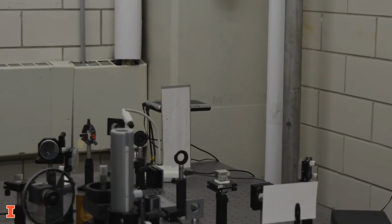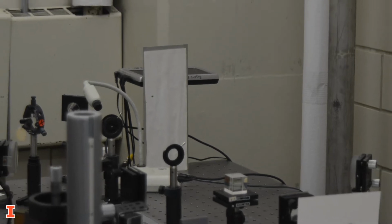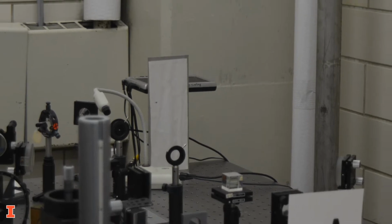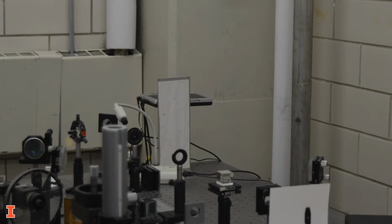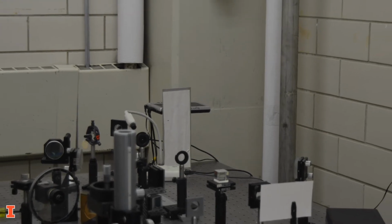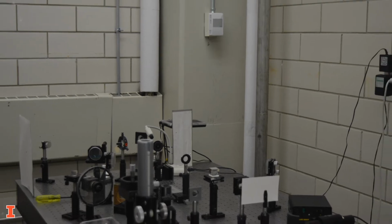Irises limit the diameter of the beam. The diameter is adjusted with the knob. Be careful of reflections from the edges if the beam clips the diaphragm edges. As we adjust the components, we must take care that the open beam is never angled upward, even at a slight angle. There are many other components that might be needed for an experiment, but we would align them following the same principles. What must we do first before we turn on the laser?